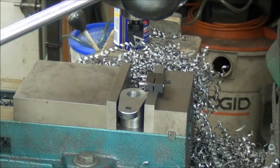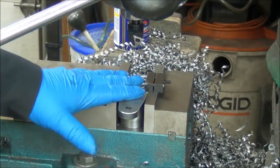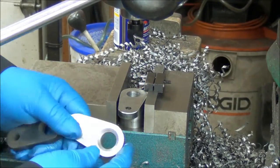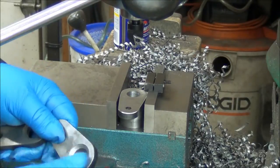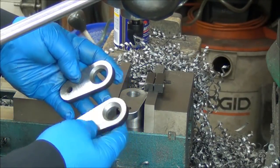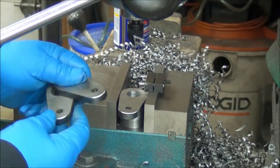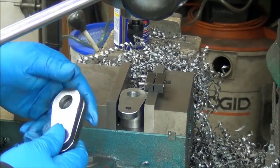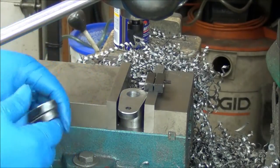I'm using my Z DRO — my little caliper-based DRO — to tell me how far down I'm going, so they turn out fairly predictable. They don't have to be perfect because that's going to get all welded in and ground back off. As long as they come out looking close after that, we need to punch the holes in here, and then these parts are basically done until it's time to weld them onto the other brackets.